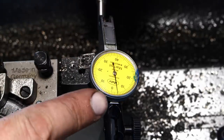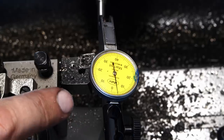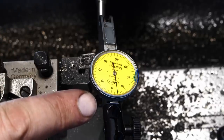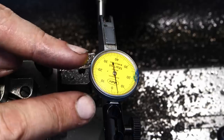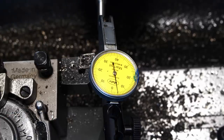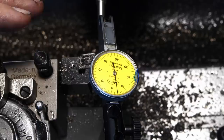The part is now down to room temperature and as you can see on the dial test indicator, we went from zero to minus 40 microns — just from a simple roughing operation. Granted it was a dry cut with fairly aggressive feed putting a lot of heat in, but those are things that will happen. That's very close to the maximum tolerance of the shoulder length already. So if I don't pay attention to thermal management, it's easy to blow the tolerances on a super simple stepped bolt just because of roughing heat. Ideally I would run flood coolant to keep temperature down.